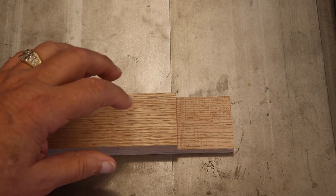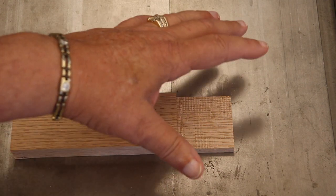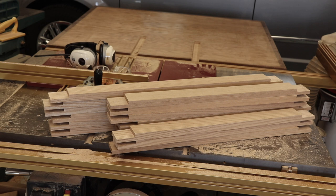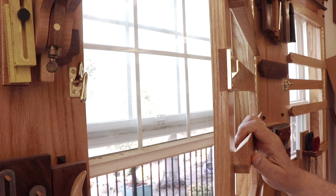This is the piece I used to make sure my half laps were tight and the correct size. Here are the 9 rails and 6 stiles after I cut them to rough length on the miter saw — I later cleaned them up on the table saw. Now all 30 of the half laps have been cut on the ends of the boards. On the stiles I needed to cut half laps through the middle. This is a test piece I did to set up the table saw to cut those half laps in the middle of the stiles.